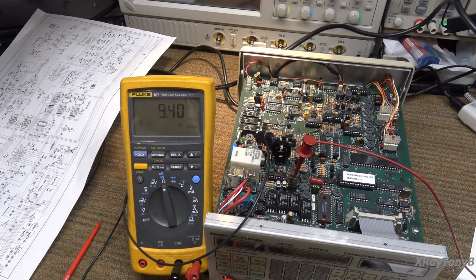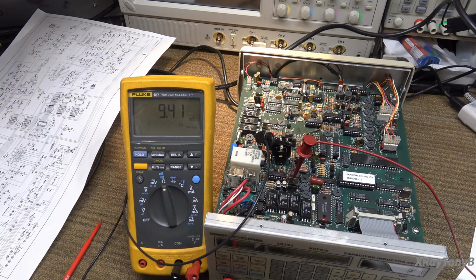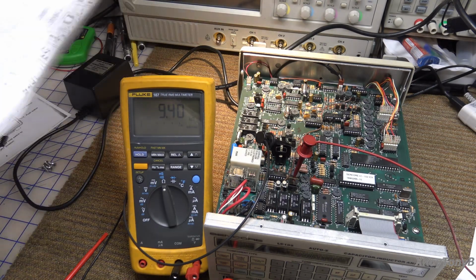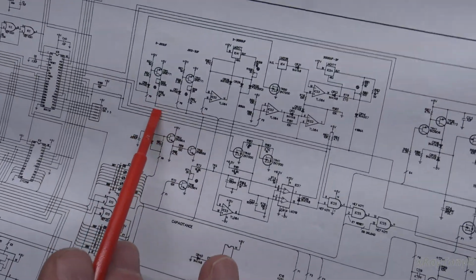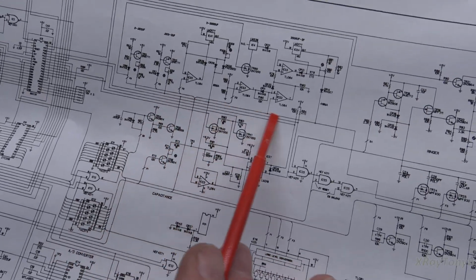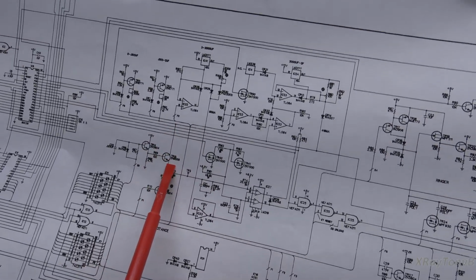So I wonder if that transistor might be bad. Now I kind of just went on to diode check and checked it, and even though the voltage drop is higher than I'm used to, almost 0.8 volts, that might be normal from base to collector and base to emitter, the forward voltage drop. But perhaps the transistor's not working, I don't know, or somehow this thing's not finding its common, but it has to, because all of these are tied together to the same common point. And they find it through this TR15.